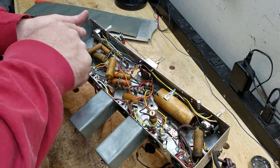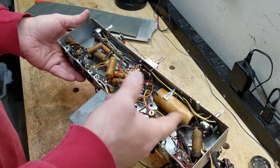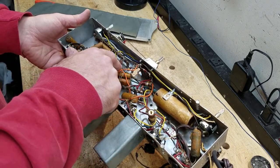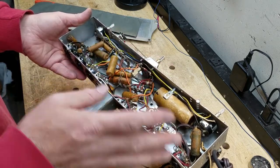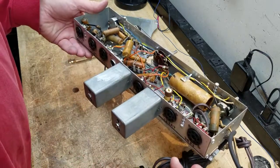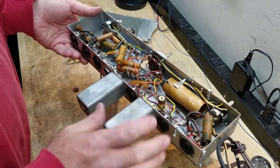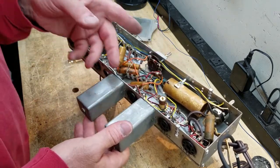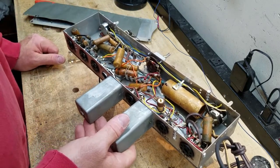I'll go ahead and do all the caps, then measure resistors. If there's a resistor attached to the same point as a cap, I'll check that resistor out right away. At this vintage, carbon resistors are often about three-quarters of them are good, so I'll check them all. I don't replace resistors if they're good — if they haven't drifted much by now, they're not going to. But the waxies will go. Somebody had gone to the trouble of replacing the power cord, which is good because I won't have to do that. It's a nice, clean chassis — I'll clean all the pots, controls, the switch, and the tube sockets.